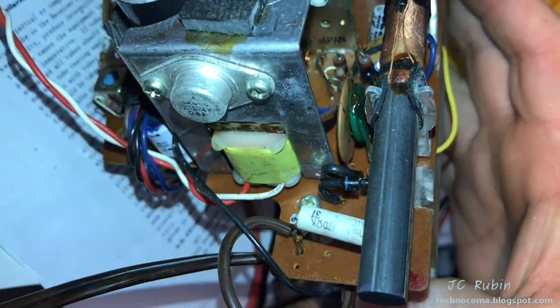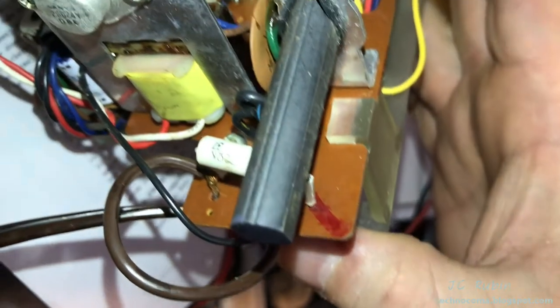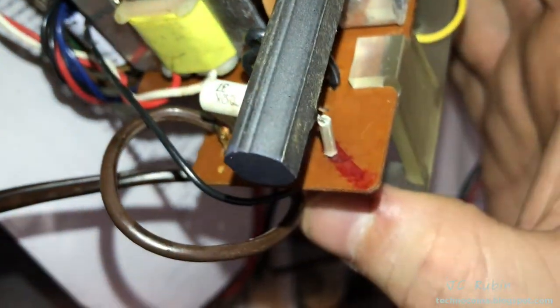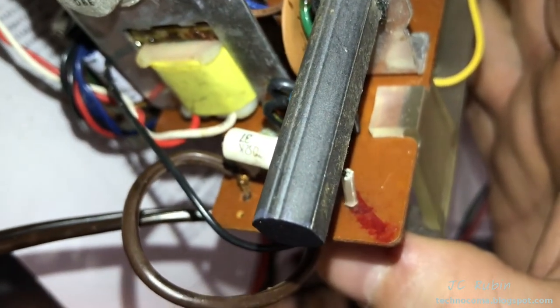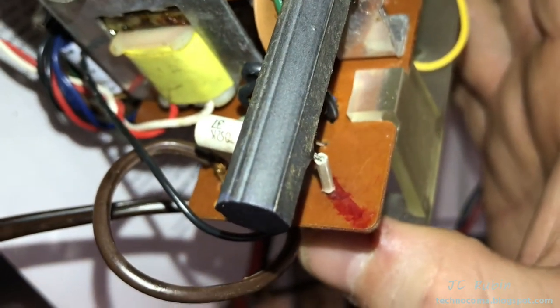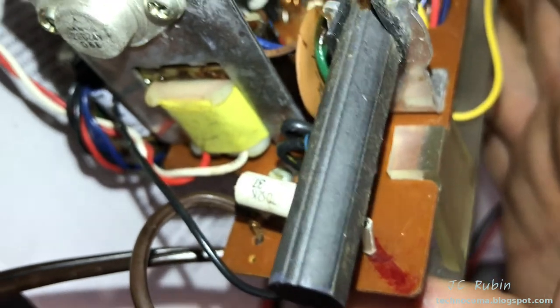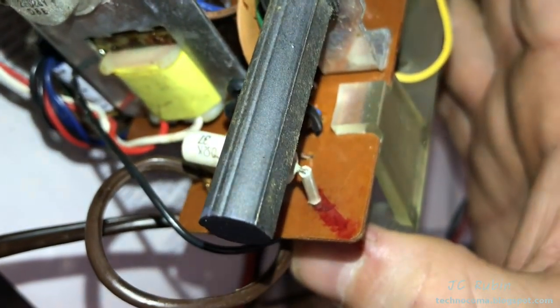And this 470 ohm resistor here, it's a higher wattage resistor. I can't see the value right now, but I'm seeing wide open on that. So the other half of the line cord is basically coming in on this, and it's being isolated. So that's why there's absolutely no power to the unit. This resistor's open. I was actually hoping for more from this unit. Hopefully I'll swap out that resistor. There'll still be some other things wrong with this, but